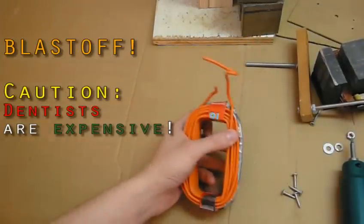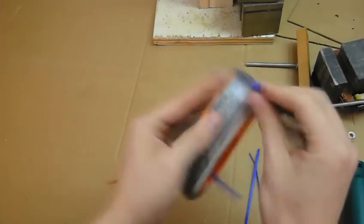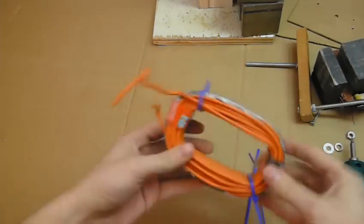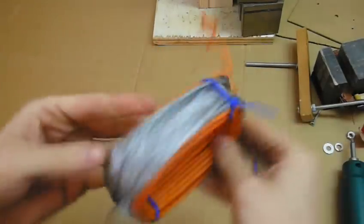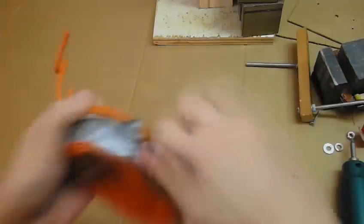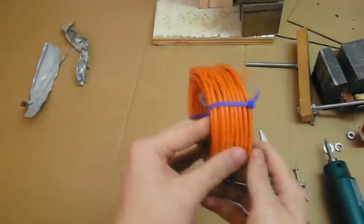Now would be a good time to zip tie the coil or add extra tape. You might even want to ask for help so you never have to let it go. If the coil shifts on you, you won't get it back together tight, and you'll be inventing new curse words starting over. Be careful when test fitting the new secondary.